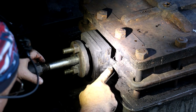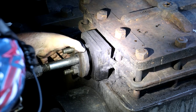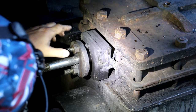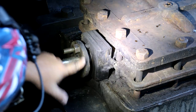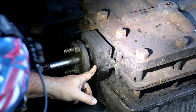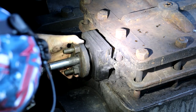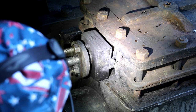You know, this is getting worse and worse. That crack extends way back in there all around this. This piece on the front here is a pusher plate that goes into a cavity where you put some packing material. As the packing wears, you tighten this up and it pushes in there, and as it wears out you pull it out and put more packing in - that keeps the steam in the steam chest from coming out around this valve rod. The original setup had two bolts coming out on the sides, and where that hole was through there, that cracked out eventually. They came in and welded or brazed a plate on the outside and brazed up all the body underneath it, and moved the studs to get some good fresh material to go into. Looks like we're cracked right there where the old crack was, so we're going to get in there, grind that out, and probably braze it up.